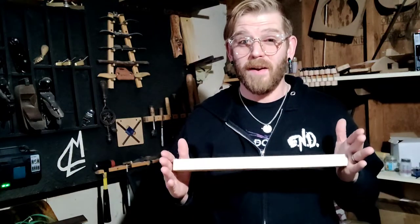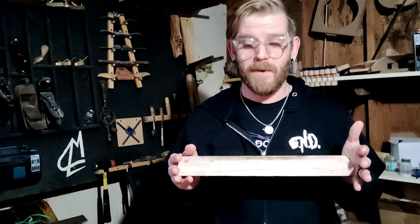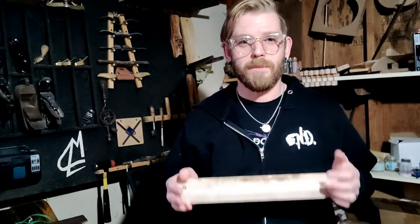I'm not going to be able to do a glue up like normal. Because this is plastic, I'm thinking I'm going to have to use a resin or epoxy to put this in place, as well as with the fretboard, because I want to have a flat plane plastic here for the fretboard to sit on as well. Which is another thing, I'm going to have to mill down the wenge for a fretboard. So with that, because I already have this neck all mapped out, I'm going to run over the bandsaw, cut this down, and we'll get to fitting this up.